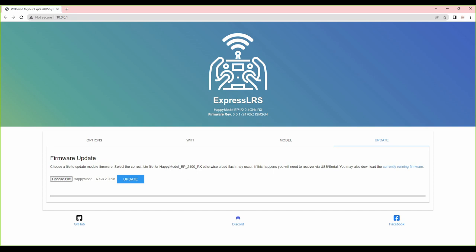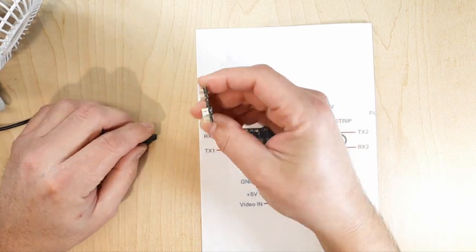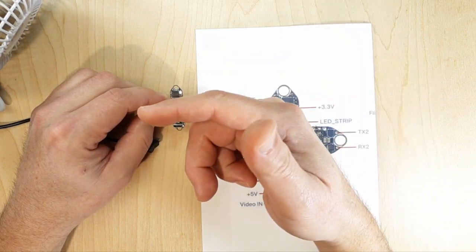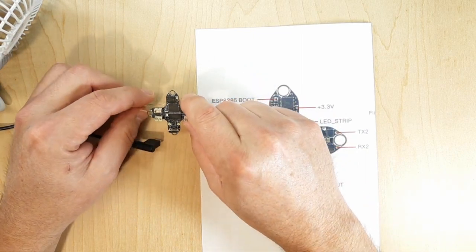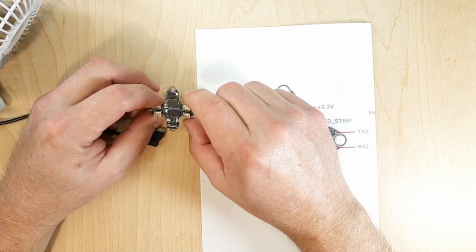The binding phrase should be saved as well — that's taken care of. Back at the bench, both LEDs went back to a pulsing pattern once the update finished. On the computer, because I have auto-connect on, it automatically disconnected from the board's WiFi and reconnected to my home WiFi. You'll want to check that it reconnects, because once the update finishes the board disconnects from your computer's WiFi and you could be left with no connection.